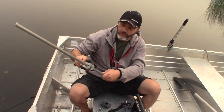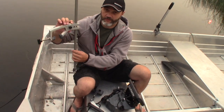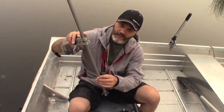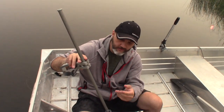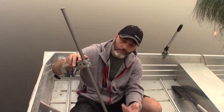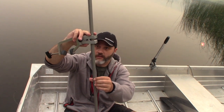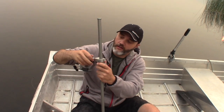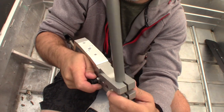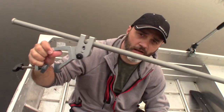This can travel up and down, so once you have it firmly clamped onto the edge of your boat — or maybe a deck of your boat, a deck boat — you can get it deeper or shallower. Maybe you have a side imaging fish finder and you want to get it below the very bottom of the boat so it doesn't impede side imaging transducer operation. Maybe you want to get it down past the motor leg. You can also rotate this 360 degrees, and you can pull this pin out and tilt it up and down to different positions. It just snaps in nicely, just like so.